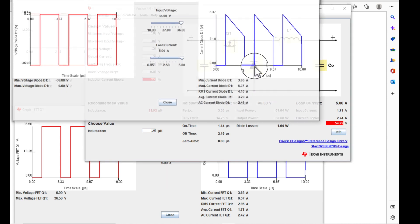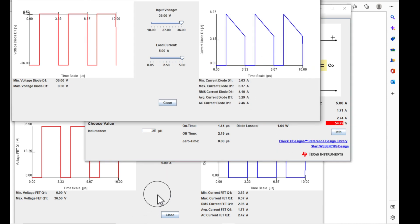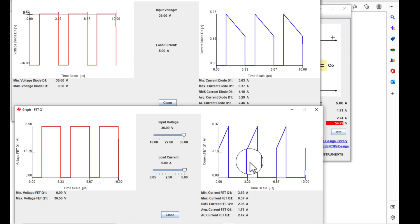Let's look at the diode and see what portion of that current comes from it. Now I've got the diode up here and the transistor down here. At the bottom you can see the off time, then the current jumps up and ramps — and then at the peak it just drops because the diode turned on. The diode was off and then boom. We know this is a perfect waveform with no dead time, so really we're going to have a little bit of dead time. It's a perfect waveform, but it still gives you a lot of insight.